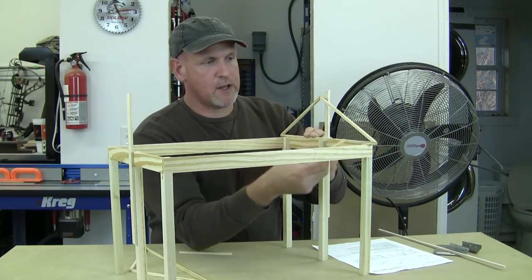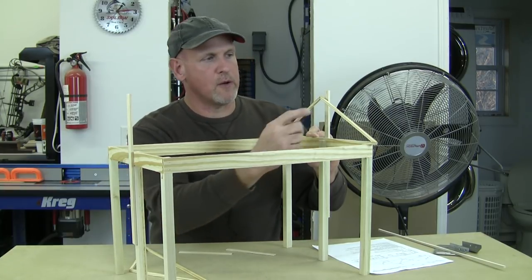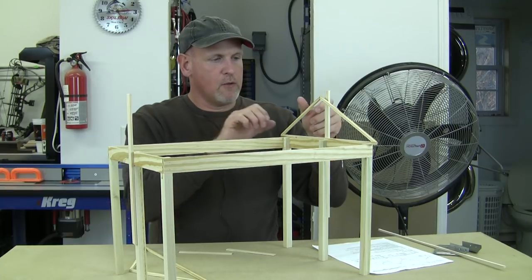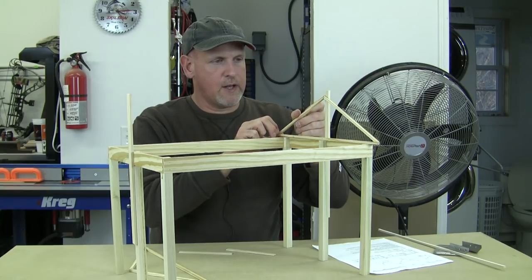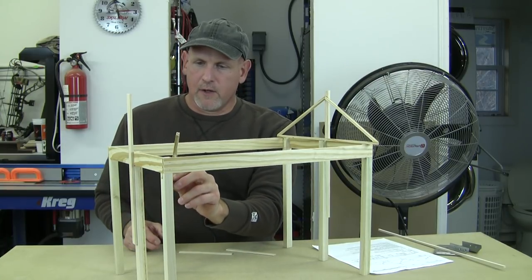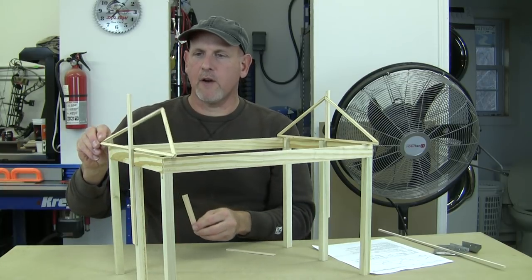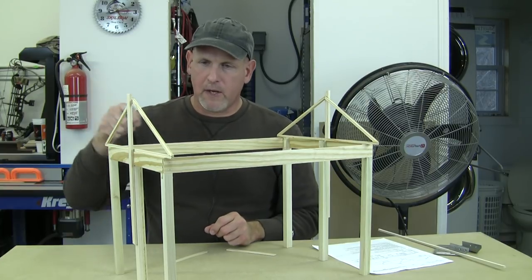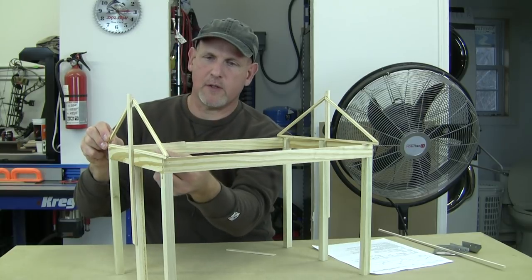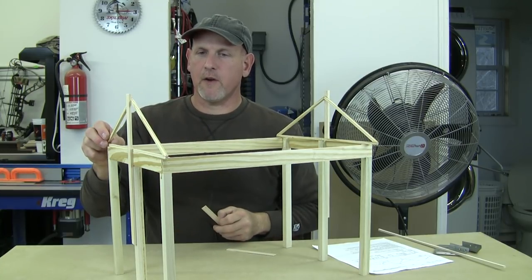The other thing that scabbing this end did was it helped keep us flush on that band. Once it's on there it's pretty secure, but we went ahead and ran a screw into that brace through the truss just to keep it from wanting to flop over. Once that one was up, we went ahead and set the other one up — same method. We kind of walked it in, lifted one side up, then grunted and hollered and complained and cussed until we got the other side up, then flipped it around. Same thing — beating and banging, getting it lined up on that band, moving it back and forth until we had the right overhang. Then we came in with the 2x6, scabbed it in, nailed it off on both sides, and secured it to the brace.